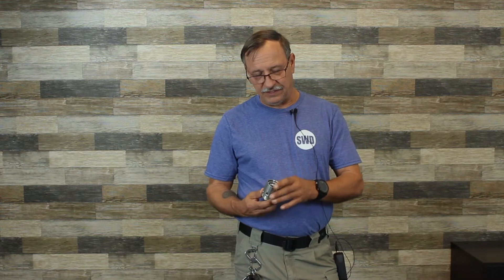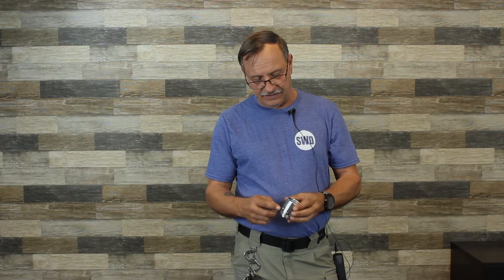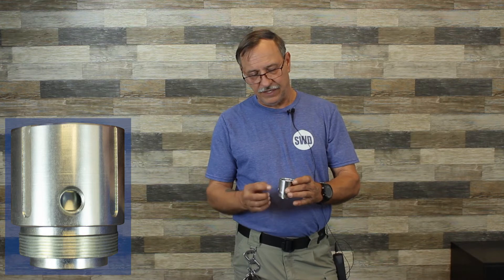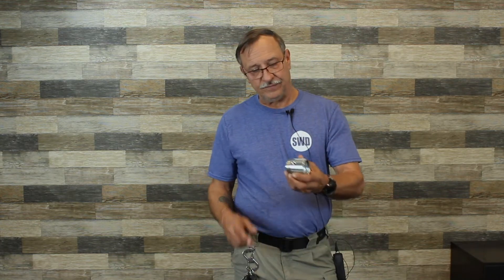The machine has basically three pumps: an A side pump, B side pump, and this is the third pump. People fail to realize that this one here is spring actuated — it's actuated by the armature and piston going up and down. It has fittings on the side; two of them are usually blocked off with Allen screws or plugs, and the other two have lines come in. Every time it compresses, it goes down to the reservoir, sucks it up on one end, and the filter part does a check valve on the other side so it keeps the fluid circulating around your shaft.